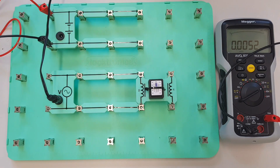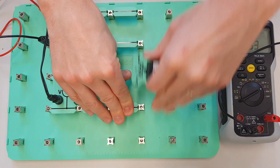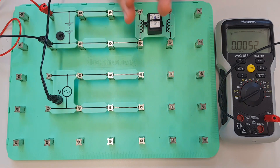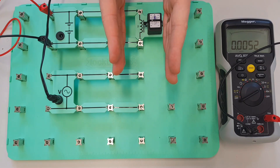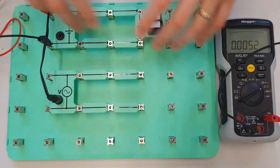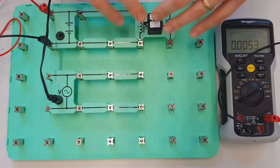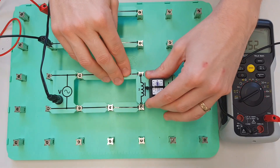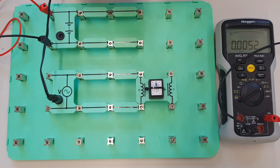Well, to answer that question we need to think about the difference between AC and DC electricity. Let's take our coil and plug it back into the DC supply. Now try and visualize what's happening with the DC supply — we've got current flowing through here, through the coil and back out of the circuit again, and in a DC supply the current keeps going the same way all the time, it's just always going in the same direction. Now what that means is that around this coil a magnetic field will appear, but that magnetic field will just stay still — it's not fluctuating, it's not moving, it's not reversing polarity — and therefore as far as the supply is concerned this isn't doing anything else to the electricity.